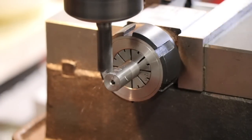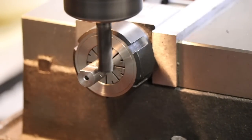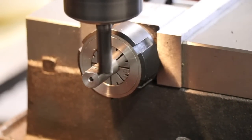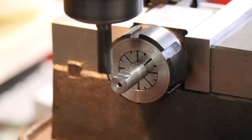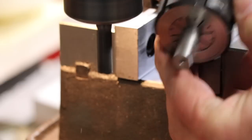The next stage is to put it in the milling machine and square up the end using a square collet block to hold the work. I just flip that over to get each side once we've got the depth down to what we need.